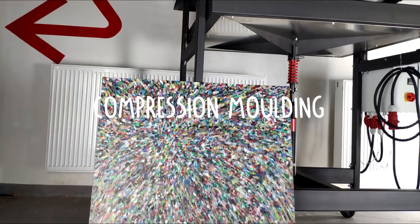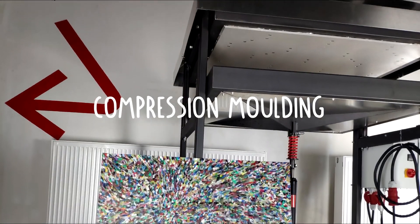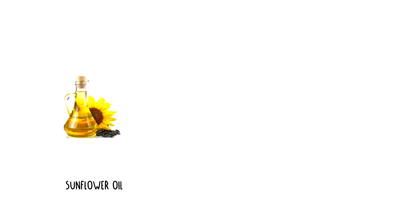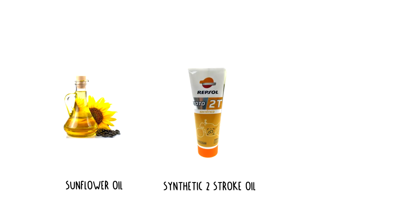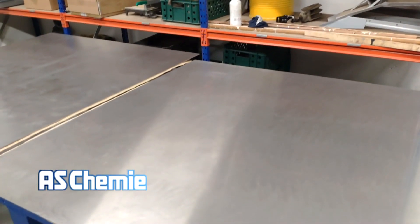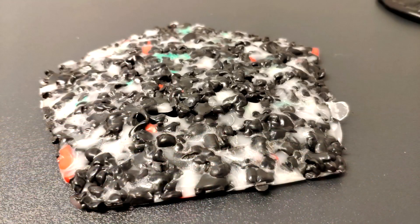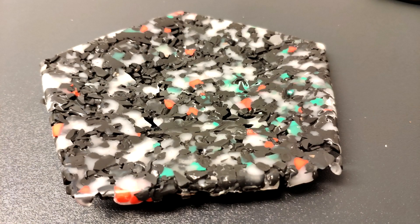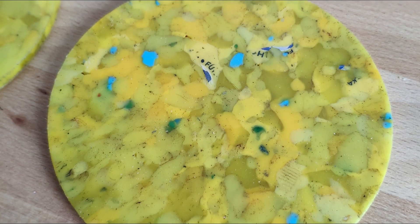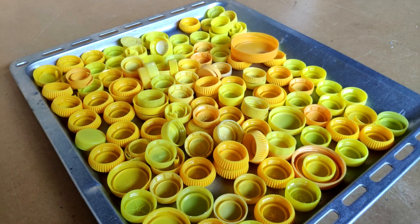Now let's move to compression molding. Think about separation to prevent plastic from sticking to the mold surface. Kitchen sunflower oil is a minimum. I can recommend two-stroke synthetic oil or black baking foil. The best industrial separator I've been using for one year is Atmoscoat. On this example you can see I tried to make a dome joint with a compression molding technique — I would have been surprised if it worked, but I wanted to try it. Dirt on plastic you want to recycle is more visible on compressed products than on injected parts, so I recommend cleaning the plastic well.